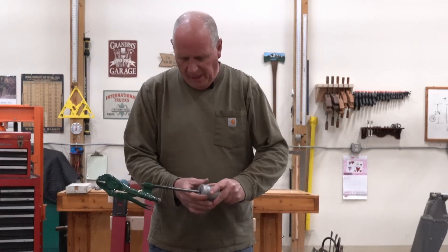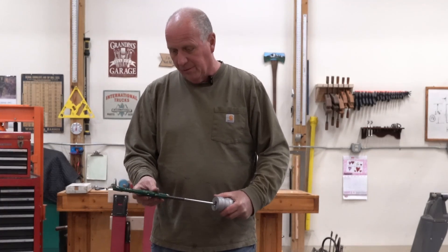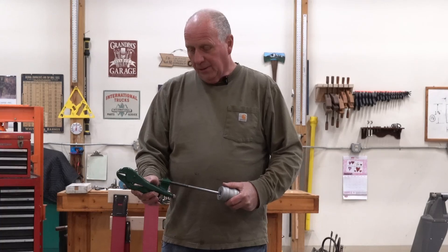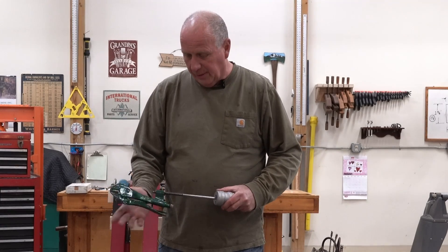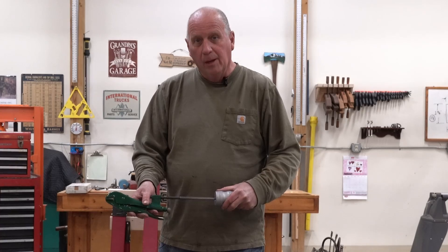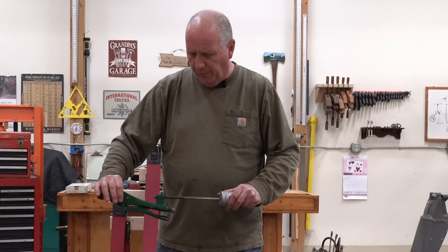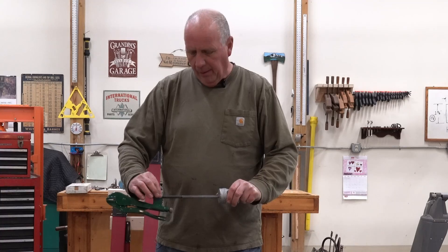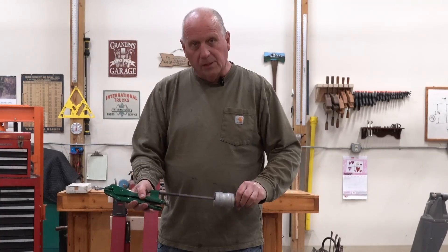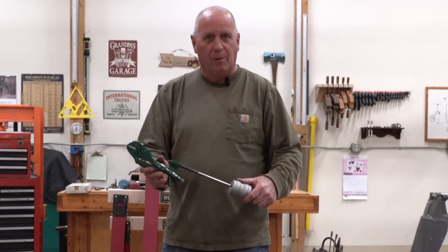Here's the completed tool — the slide hammer with the locking pliers. They appear to work fairly well, especially for removing cotter pins, which is probably where I'll use this most since they can be pretty stubborn. The idea originally came from Farm Show Magazine — a great publication with all kinds of great ideas. The author had other attachments he made for the slide hammer as well. I'll include the article info and part numbers for the vice grips, coupling nut, stock piece, and the slide hammer from Harbor Freight in the description. Thanks for watching — if you enjoyed it, give me a thumbs up, and send me any comments you have.